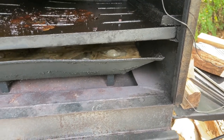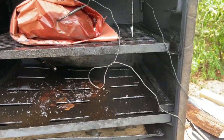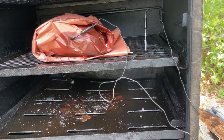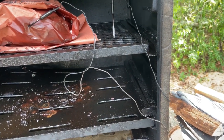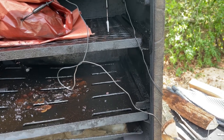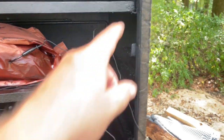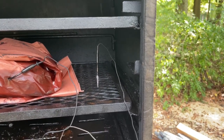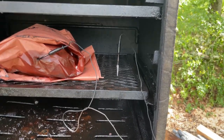Right now the water pan is full of water, but the worst welds were on that pan. I actually called the manufacturer and discussed two improvements: first, use the next gauge up of metal — I think this is 11-gauge, and stepping up to something close to quarter-inch would give more mass and durability, though it would be heavier. Second, put C-channel in where the shelves are, so you could pull them out partway without them flopping over — right now there's nothing holding them in the back, so pulling a shelf with weight on it would tip it and drop your meat.